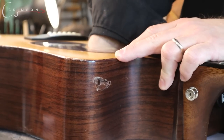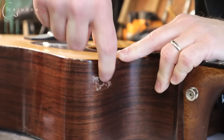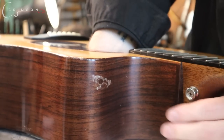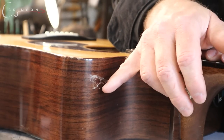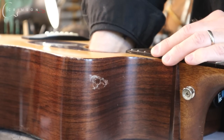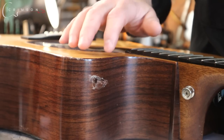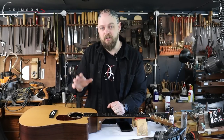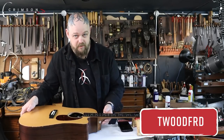Now I have access. So I need to try and — it's going to need clamping to pull it out. But that actually appears to be closing the gap entirely, it's so tight. So I am going to need to flood it with not superglue, just standard wood glue, and that will give us time to mess around and get the fit correct. I don't do repairs on a regular basis — you guys should check out Ted Woodford's channel, he is incredible.